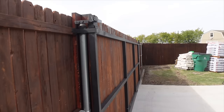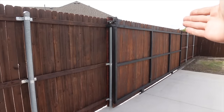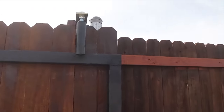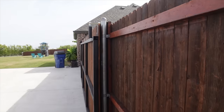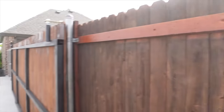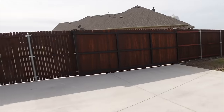If you guys are trying to tackle something like this, the material we used was two-inch 14-gauge steel — go find yourself a metal supplier, because that was the biggest win of the day. One major concern I do have is this pole: we put a lot of concrete down there, but these poles are not known for being very strong, and with the weight of the fence and the gate, I've got a feeling that come one of these Texas springs with tornado weather, it's not gonna last. Stay tuned for a few months from now. Thank you for hanging out with me — today's project was all about the privacy in front of the shop, which is gonna be very important moving forward. Our next task with the Dream Shop is the roof. Aloha.